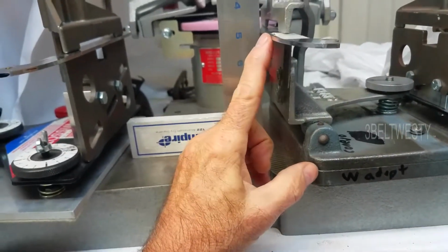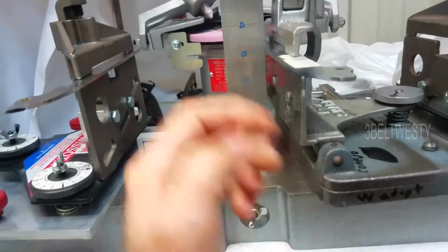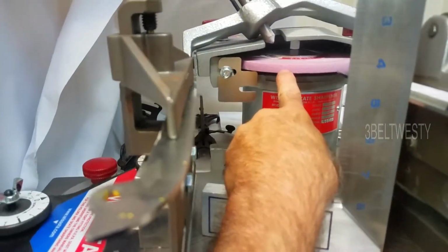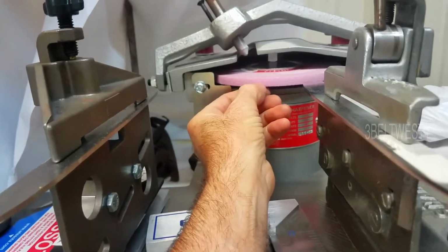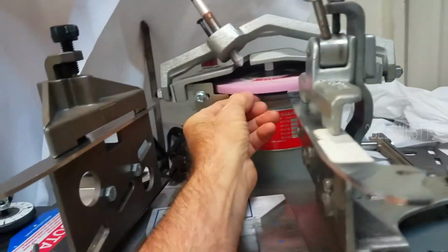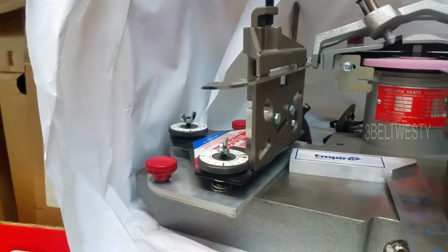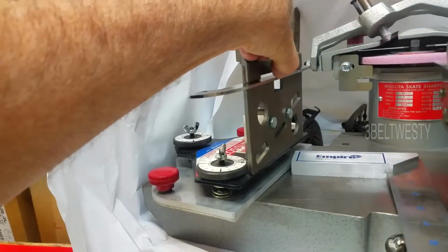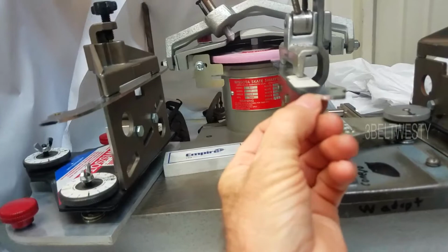So what you do is you want to have it so that the nominal setting on this is to where when this is level, or on this one you want to have it so it's hitting actually at the center of curvature where it's cut by the diamond over here. It's not necessarily where the wheel is, but it's where the center fattest bulge is, and that's determined by the pivot of this point and over here. And what happens with that is that means you use this for small adjustments. So normally you want to have one of these set up nominally for hockey, to where for the average type of blades it's pretty much on the money. You're not fiddling with this. Same thing with over here. So that with minor adjustments, you're not going to get a curvature error along here.